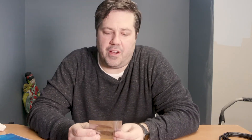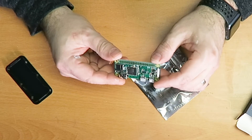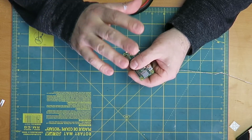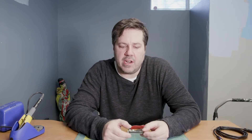The final and most important part is the Raspberry Pi itself. This is a really small Pi device — if you're familiar with Raspberry Pis, they're usually much larger. Since this is going to be used in a system designed to go outdoors, I wanted something small, compact, and very low power. The next step is to take these headers and solder them into place. The headers go facing up away from the Pi, allowing extra components or Pi hats to be connected on top.